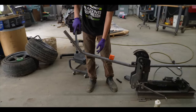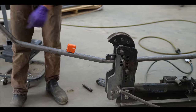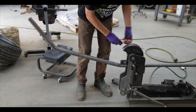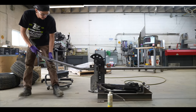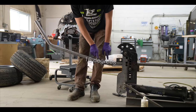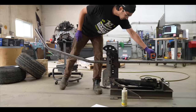You can see the first bend — I line up my mark with this part of the tube bender and bent it to 34 degrees. Same deal with the second bend: my mark was right here and I bent it to 16 degrees, which gives us this angle. Now I have the last and final bend to do on this pipe.